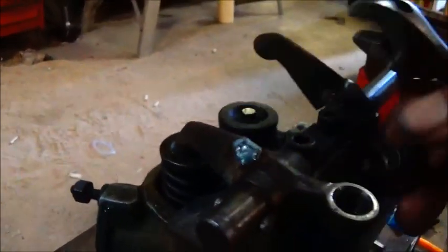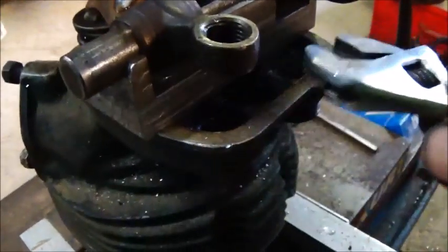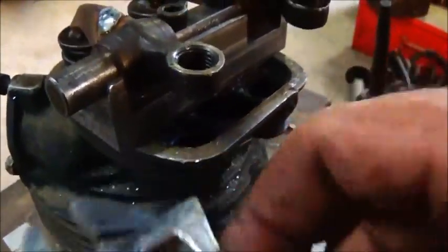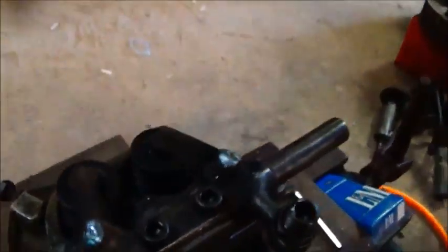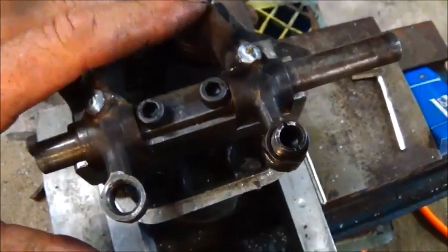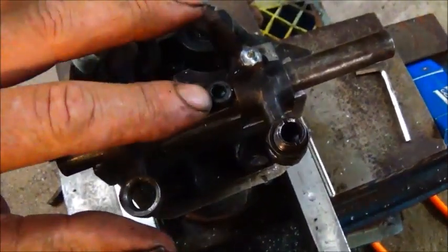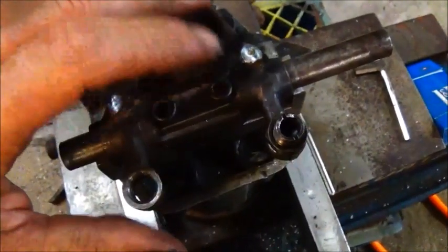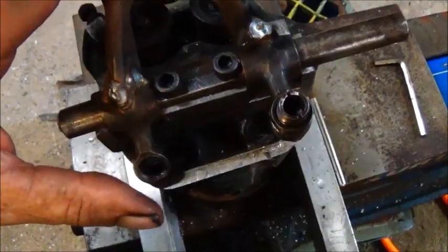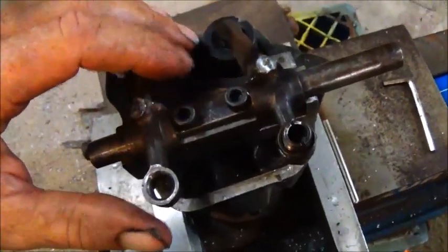If they don't roll good and when you open up they actually try to pull back on the valve, it'll pull the guide out really quick. You can rearch this a little bit to get it rounded, but you want it to work really good. We're going to do some machining, take this off, do a little cleaning up on the rocker stand. I used socketed cap screws — when this is all together on the bike hopefully you can't see that. For clearance issues I didn't have a lot of choice, but they're not going to give any trouble.